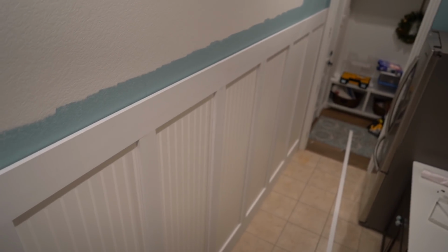All right, so here's a view from the top. Down behind here is the beadboard paneling. You can see it right there, behind the 1x. So there's a gap between the wall and the 1x, and we're just going to solve that with our 1x2 cap. So I'll put our 1x2 cap here. And the good thing about this cap also is that it's flexible. It can be pushed up against the wall if there's a crowned stud sticking out, and it hides a gap. So I'm going to go ahead and install this right now.